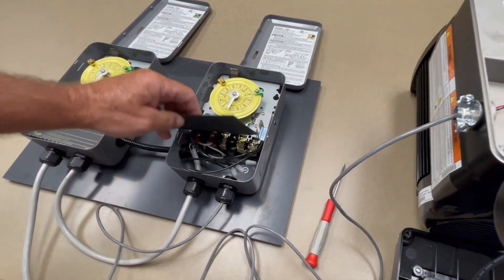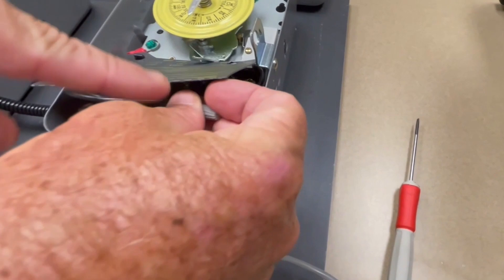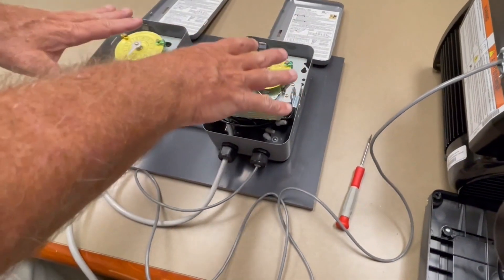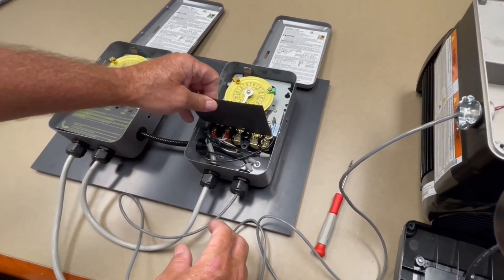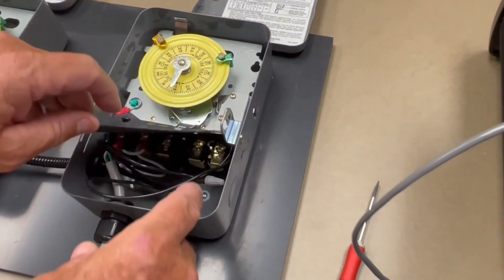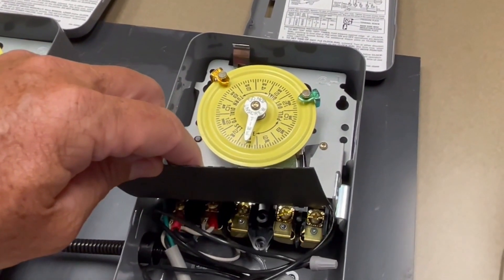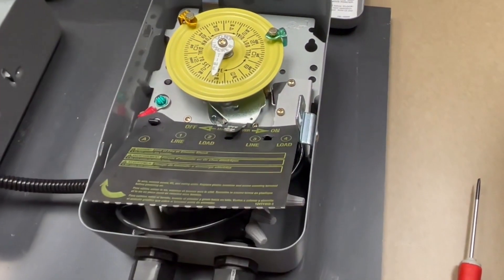One lead we're going to use to connect into the 12-volt supply. There's a red lead that comes off the motor — it runs in here and we've got it connected into this one, then daisy-chained over into the lead off the second clock as well, so both fireman switches are powered with the 12-volt supply. On this clock we've wired in the 1898 RPM speed — the white lead goes on the other lead that comes off the fireman switch. Everything is wire-nutted up and snug.